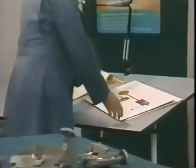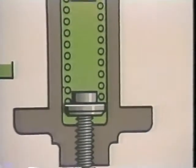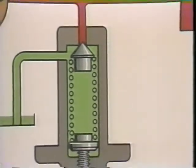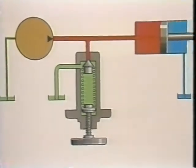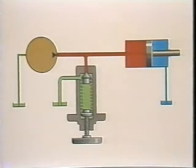Let's start with the relief valve. In its simplest form, it doesn't have to be any more than a ball or poppet held on its seat by a spring. We would just tighten up on the spring until it was easier to move the cylinder with its required load than it would be to push the poppet off its seat. Oil, like all liquids, takes the course of least resistance. If the cylinder is overloaded or stalls, the increase in pressure overcomes the spring load on the poppet. The poppet is then lifted off its seat, permitting the pump delivery to go to tank at a safe level.